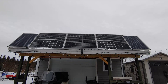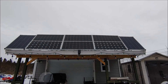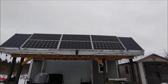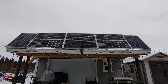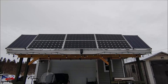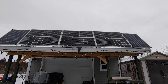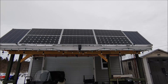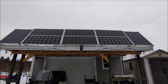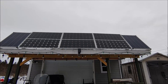I've got them set at fall and spring angles. An easy way to figure out the angle for certain times of year: summer solstice, it's whatever your latitude is in the northern hemisphere — here I think it's in the 30-something degrees. You add 15 for shoulder seasons, and I think I'm at 66 degrees for the winter months. So they're adjusted in between right now, and it's almost February.